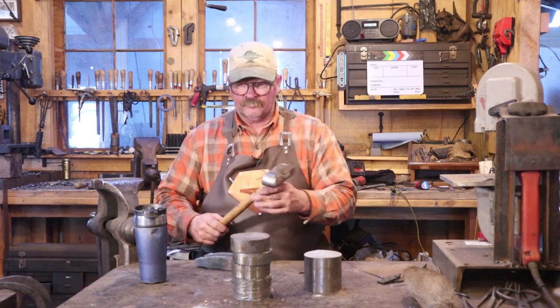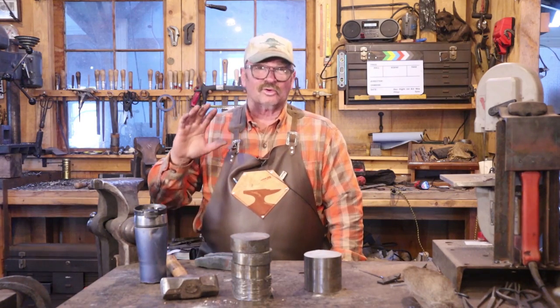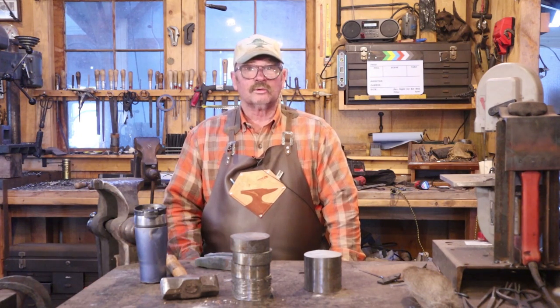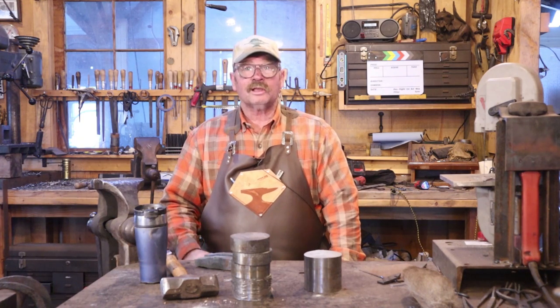So this is just going to be a part one video because that needs to cool as slowly as possible or it's going to be a real bugger to grind and I want it to be easy to grind, so I'm going to cool it overnight. And since the sun is setting, it's a good time to quit for the day, so I'm going to head in.